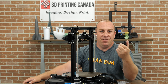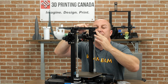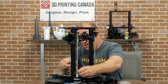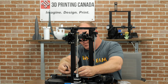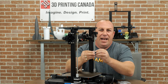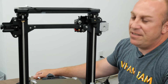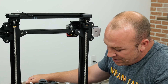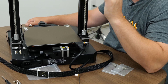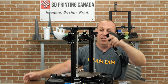The next thing you're going to do is take this cable clip and pop it right on the Z-axis. Then go ahead and pull off all the little tape from around your printer. Go ahead and plug in the Z-motor. Never do this while your machine is on — never unplug or plug in a motor while your machine is on. You don't want reverse current getting back to the board; it could cause damage.